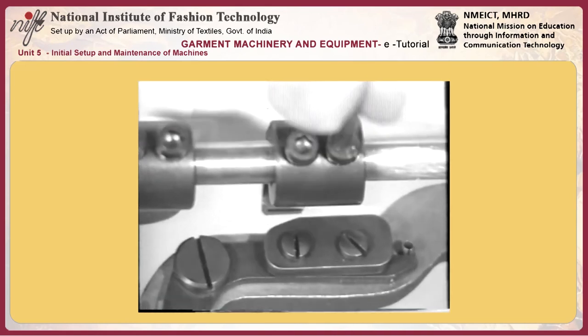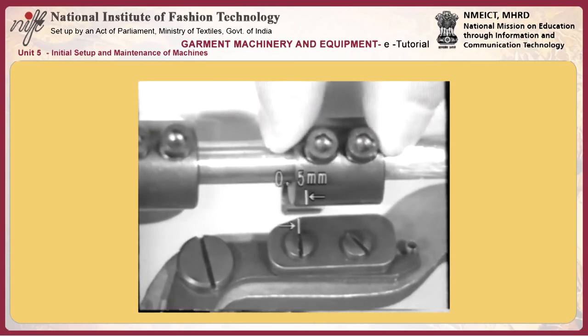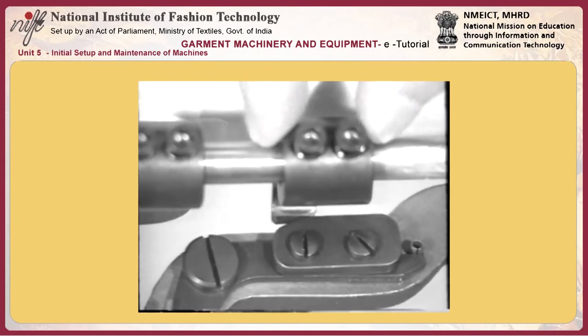If an excessive amount of oil gathers in oil return felt F, the lubricating oil amount will temporarily increase. After the excess oil is returned, normal oiling conditions will be restored.